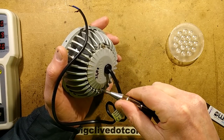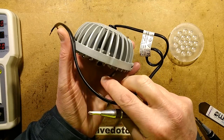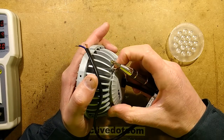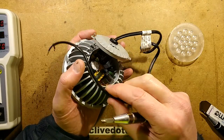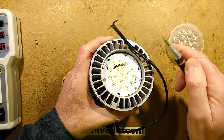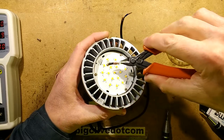So let's get the back off and see if we can take a look at this power supply. The LEDs have failed quite widespread, so that is the main sort of failure thing. It's a lovely casting — like so many of these are, it's just so chunky. It just seems wasteful that once it fails, you consider how little material there was in traditional lamps. The wires — the insulation has gone very brittle. They've obviously seen a lot of heat in here, which is of course why most LEDs fail.